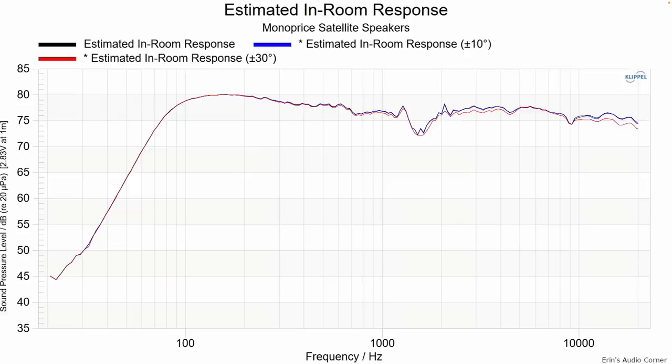This is the estimated in-room response, which gives you an idea of the tonality you can expect in the seated position in your room. Zero degrees is black, 10 degrees in blue — pretty much identical — and 30 degrees is in red. The red smooths out, and there's a bunching up around five to maybe seven kHz where responses stack on top of each other. Right in there won't be a lot different when you turn the speaker on versus off-axis. The high frequency is going to sound a bit bright compared to the mid-range, but you can EQ that down without any problem. If you're using this as a home theater setup for a small room, your AVR should be able to take care of this with no problem at all.